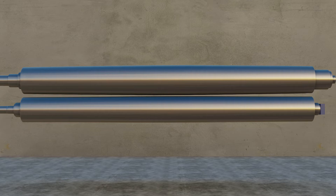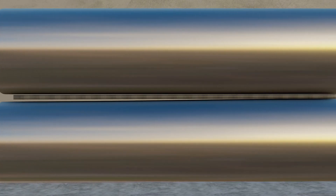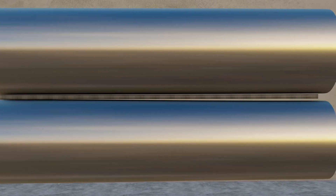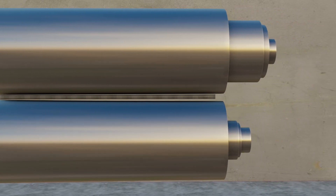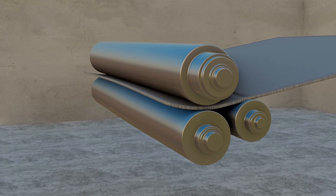When working low in the machine's capacity, the force required to bend the plate is much lower, which does not deflect all of the camber out of the rolls. It pinches tighter in the center and looser on the ends, and therefore the center of the part rolls tight and the ends will roll loose. This is called a reel defect.